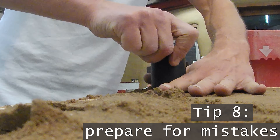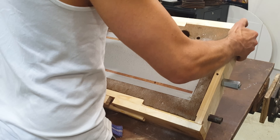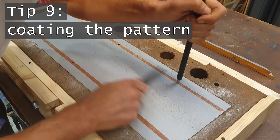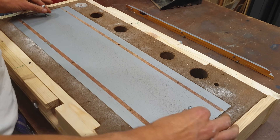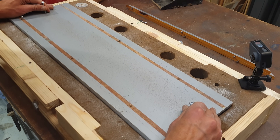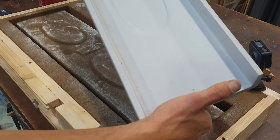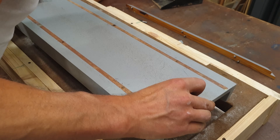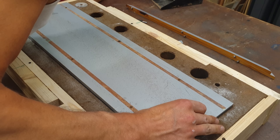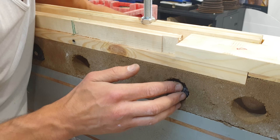Tip 8: Prepare for mistakes. Even if you've been doing this a while, it's likely you'll learn something new on each casting. This one's about the coating on the pattern - I've tried various different things. Some of the best seem to be thick epoxy primer, which is good at covering over little defects and divots. Rattle cans of cheap matte car paint seem to hold the parting dust quite well. I also like the traditional shellac finish, which is less noxious, though it does tend to require a slightly finer finish on the surface of the pattern. It wasn't necessary to remove this pattern before I'd rammed up the drag - see those big gaping holes in the sand? They're going to make it quite difficult. So let's reverse: screws out, we need to get the pattern back up and push those risers back in.